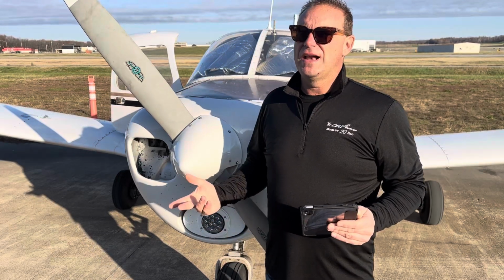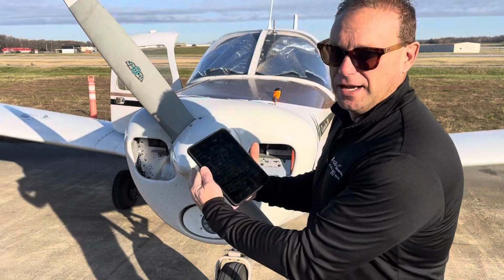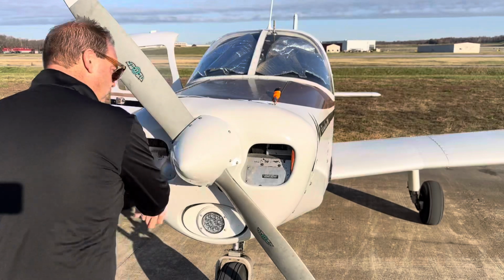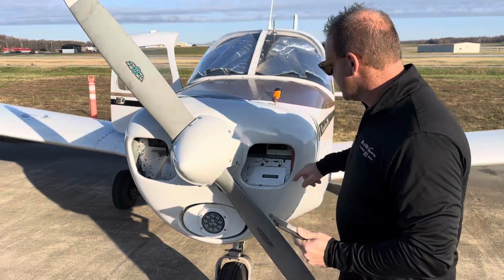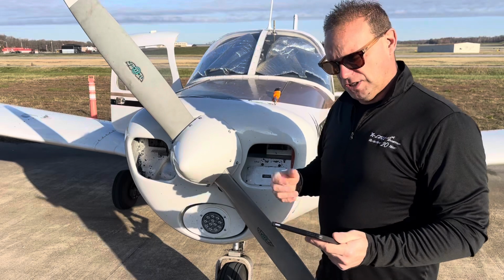And if you've been flying a lot in the summer, you're going to forget about this. You shouldn't, because right here, again, it's right there on the checklist. Every time you do your pre-flight, you go oil cooler, alternator belt, oil cooler plate, nope, temperatures look good. So you've got to be on top of that. That's 100% every pre-flight checked every time. Okay, so it's a big deal.